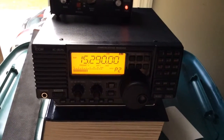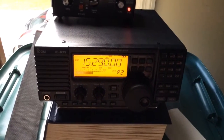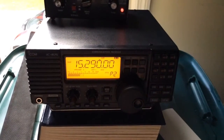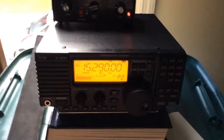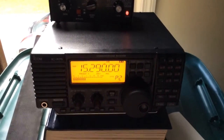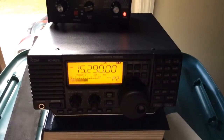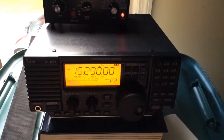It is about 1600 hours Zulu. I'm tuned into Radio Japan via a relay site in France — a 500 kilowatt transmission, strong, propagating very well here. But 19 meters is beginning to close, so band noise is creeping up and is now pretty considerable. I wanted to show a couple of ways that you can use the features on the ICOM R75 to tackle band noise.